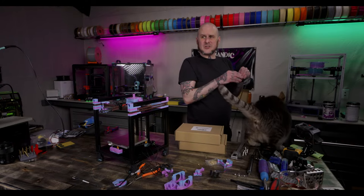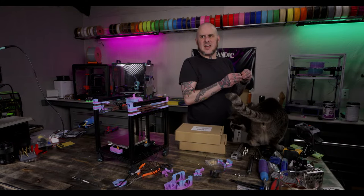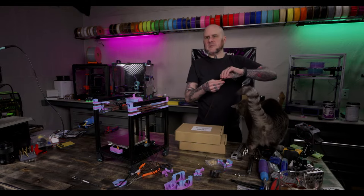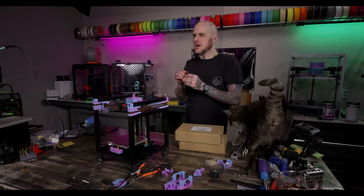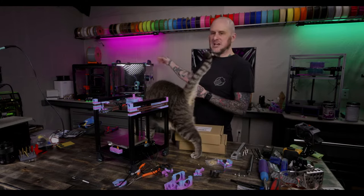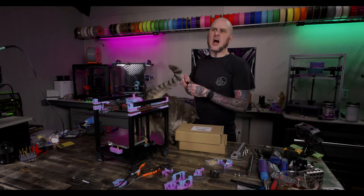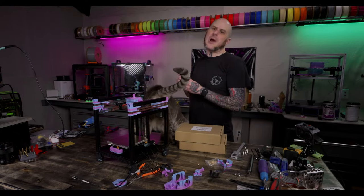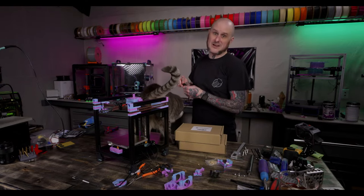Lock the tool heads and gantries in place. Yes, that's absolutely something I'm going to be looking at. A way to block. For each machine, I'll probably design some way of locking the gantry in place. Like a printed part that if it cracks or breaks, it's not a big deal compared to the rest of the machine.